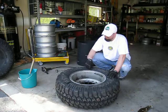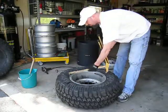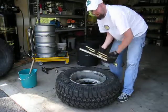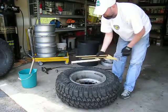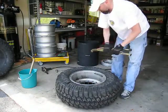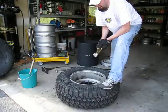And if for some reason it's just giving you fits and not able to start, just use this same technique where you start out just by hammering this small piece in and just work it maybe an inch at a time. You may need to go back over it a couple of times. It saves a heck of a lot of frustration just getting that starting point, because this is something you can hammer in. Once you get the tricks down, these tire pliers are something that are extremely handy for popping beads.